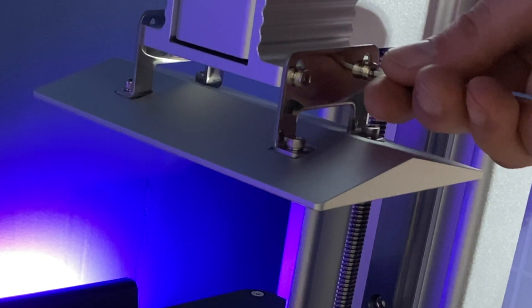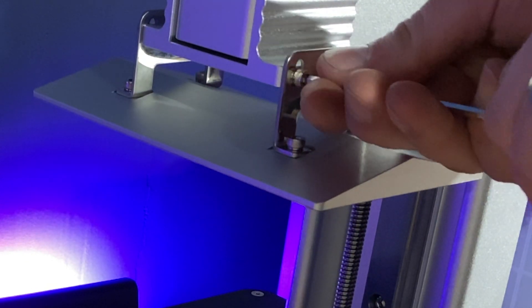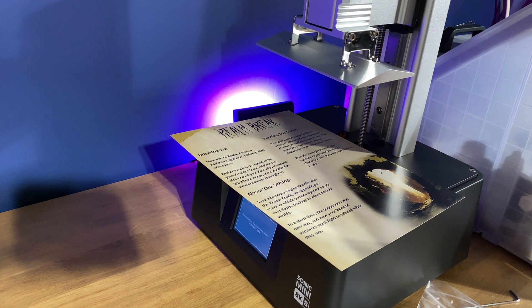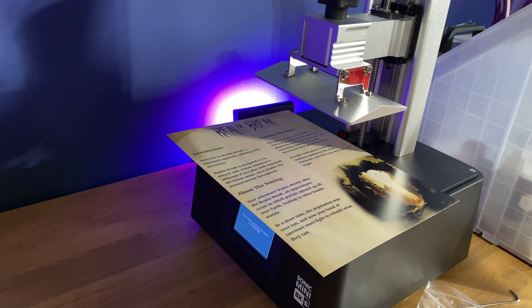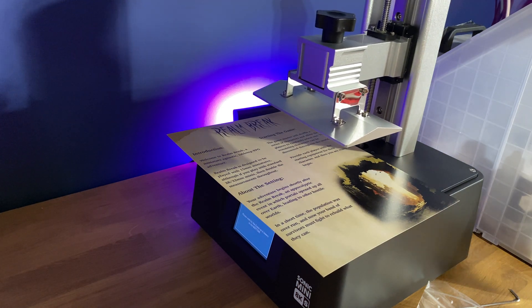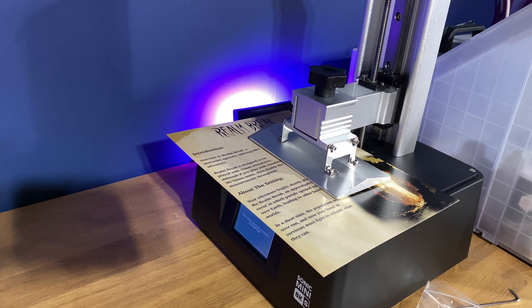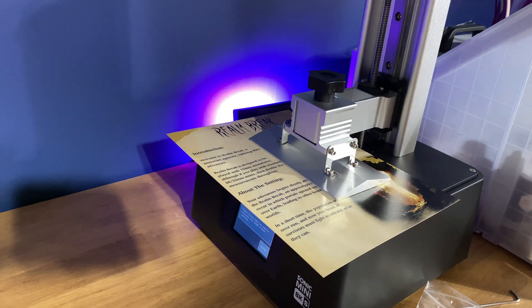The first thing you do is loosen the four screws on the side of the build plate, then go through the menu and start the leveling process. What this does is drop the build plate down and, because you've loosened those screws, it gives it the flexibility to do all the angles. It does suggest using a piece of paper, but I would really recommend using a nice thick piece of card or at least a piece of paper folded over a couple of times — whenever I've used just a single sheet of A4 it's always been just a little bit too tight and causes issues when I come to print.